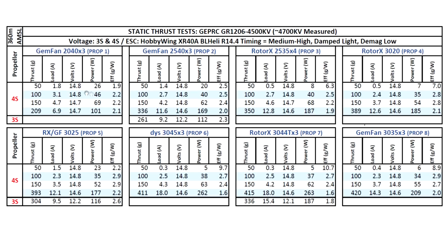Something interesting about this motor compared to other motors of its size, like the 1304, what we can see is that for the light propellers that are not so aggressive, the 1304 is actually doing pretty well. It's making slightly more thrust than this motor, although it is using higher amps, but it is spinning faster. Well, that 1304 I tested, it's got about 100 or so higher KV value. They're pretty close, so that's interesting that the 1304 seems to be spinning the light propellers a little bit faster.